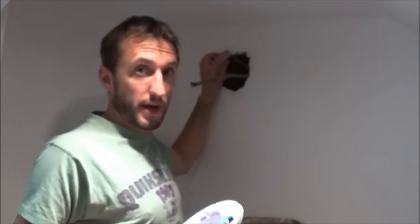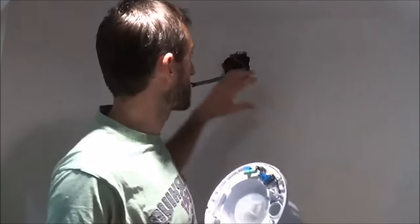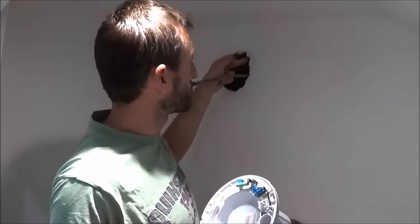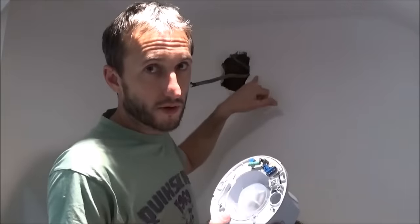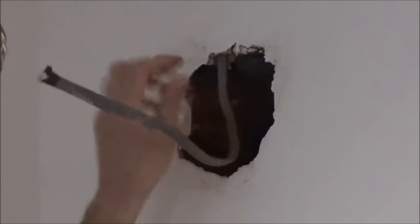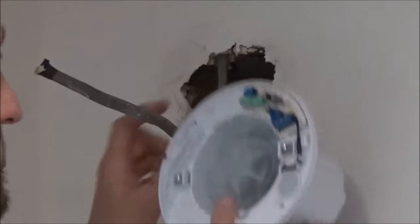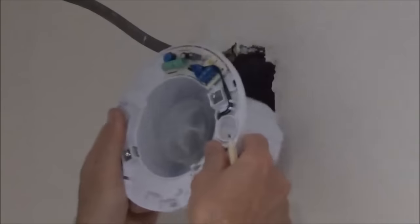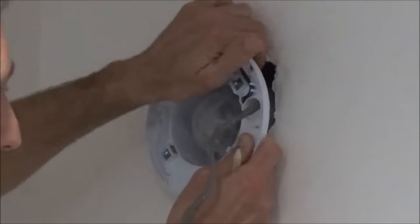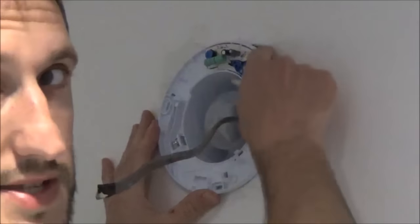I brought my cable through the top of the hole — ideally you should line your cable up with the hole provided in the fan. I'd recommend getting the fan first, then doing the hole and working out where your cable goes. I put a piece of conduit up into the ceiling and plastered over the top. To physically fix this to the wall, use the level line on the fan to ensure it's the right way up, then mark your drill holes.